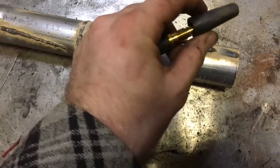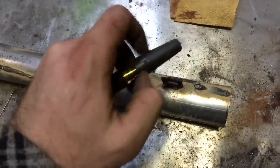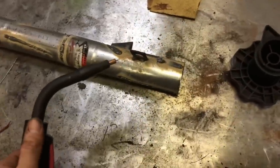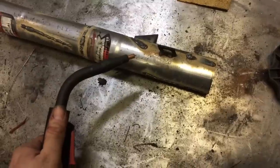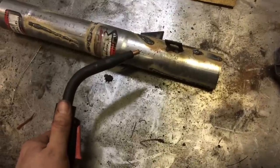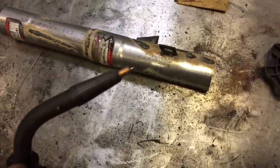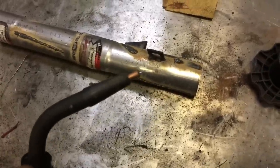The end piece right here is actually some kind of metal or plastic — I'm not really sure. It kind of feels like metal, then again it feels like some kind of hard plastic. As you can see, it doesn't really have a brass shield like your Hobart's or your cheap Harbor Freight or Miller would have. One thing I don't like about this — it's a downfall of this welder — I'm used to using the Hobart, which had the shield around, and I could just fill and come up a little bit. With this, if you get too far down, it will stick. I'll have to get used to it; I've never seen a tip like this. Not a lot of people use this kind — I guess it's just a little bit cheaper.